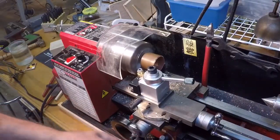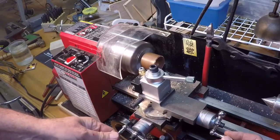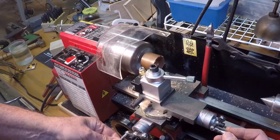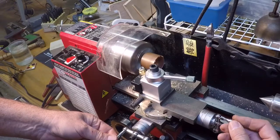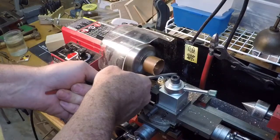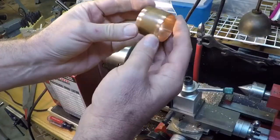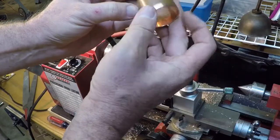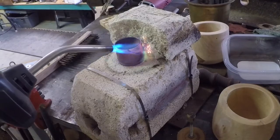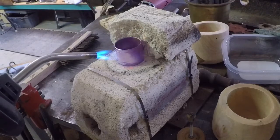I've cut this off with a hacksaw and I'm just going to clean up the edge here. I'll make a nice liberal chamfer on this, just to have a nice square cut edge to work with. I'll do a chamfer on the outside and on the inside as well, and I'm just using the file to round over the sharp edge from the chamfer. Now we're ready to soften it up and do some hammering — put some heat on it and in a minute it'll be glowing, then we'll just let it sit and cool by itself and that'll soften it up pretty good.